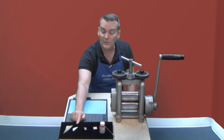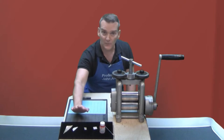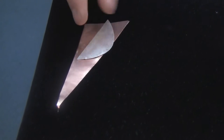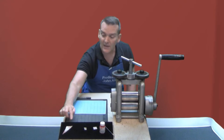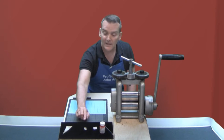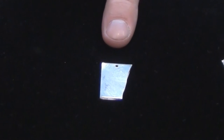What you'll do is melt solder on one surface of the silver — in other words you're going to be sweat soldering. After that solder is melted you'll then put the silver item on top of the copper like so, and then reheat it so that the two layers become joined together. What you'll end up with is a piece of metal that's copper on one side and silver on the other.